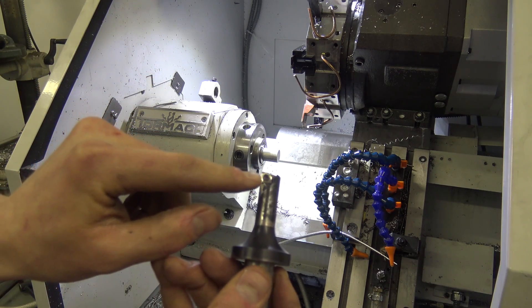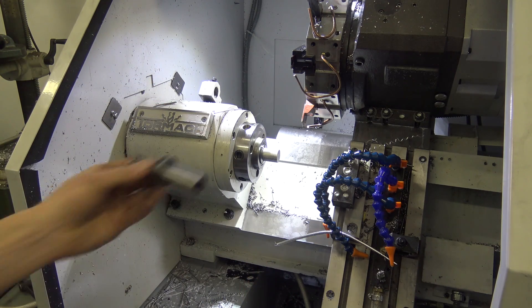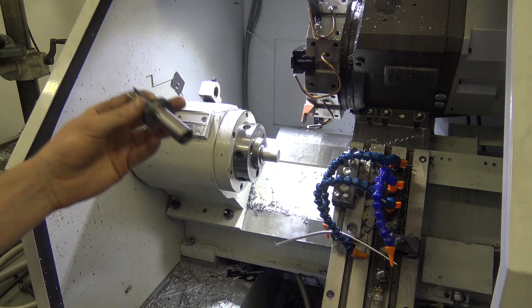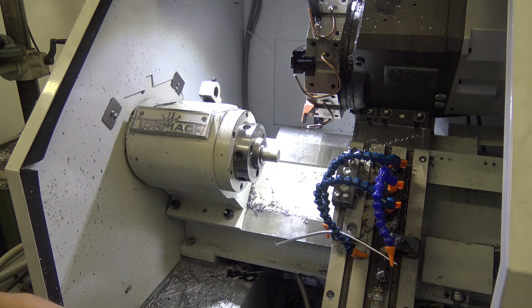The tool is cutting great and I got so excited because it's Friday afternoon and this thing is going to be awesome in the lathe. We've got a polished aluminum cutting insert here and the same tool can do steel. It's great because it gets rid of expensive twist drills that go dull, and you can use this to open up a hole before you stick a big boring bar in.